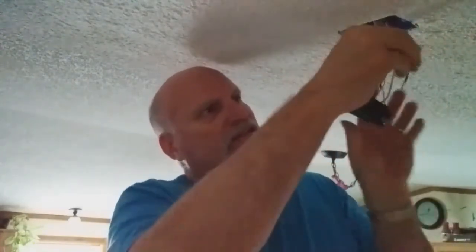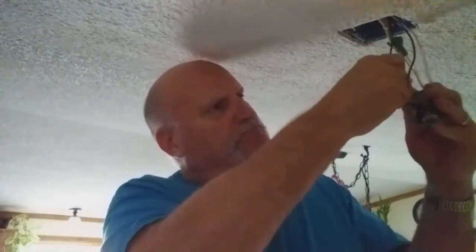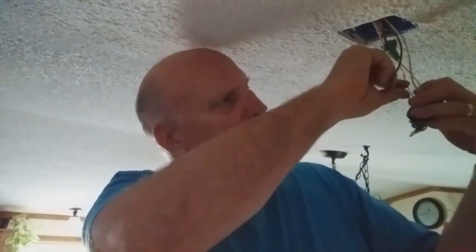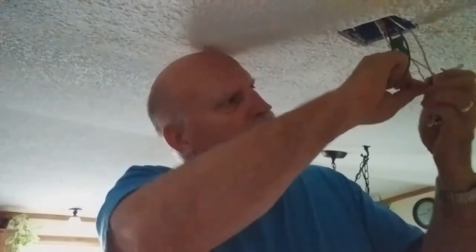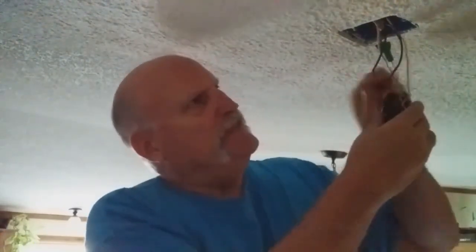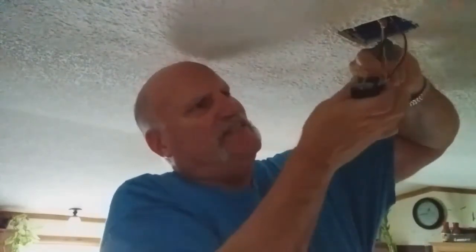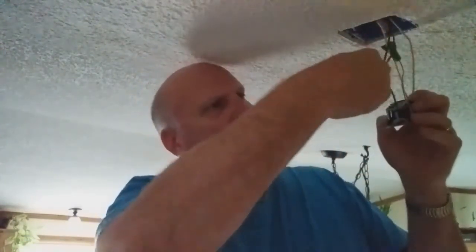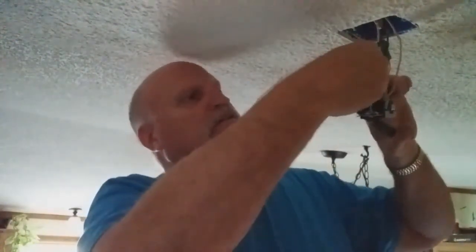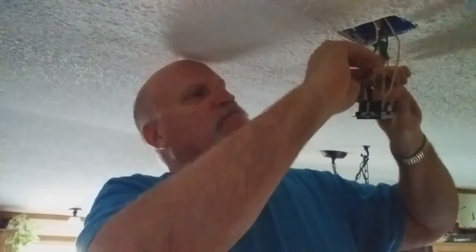All right, now for the black on the more shinier side. Again, find the round hole. If it doesn't work, you can always pigtail it around the wire end. And since that one was rounded around the wire nut, I'm going to strip it and start with a flat piece.